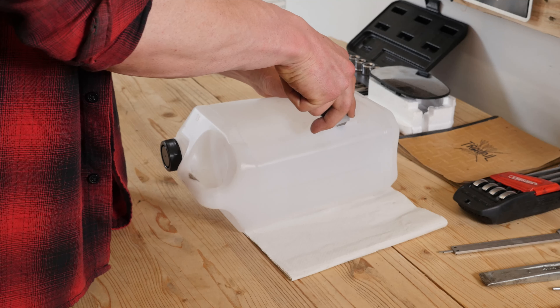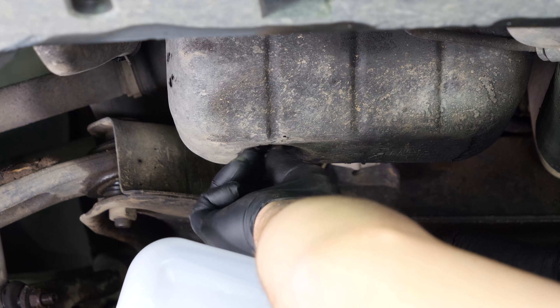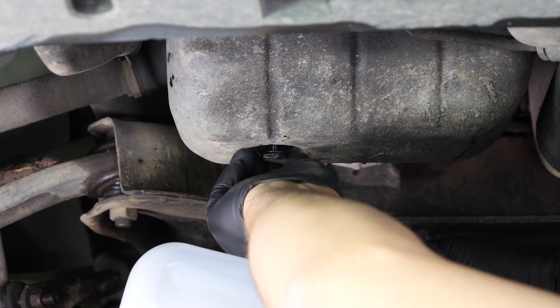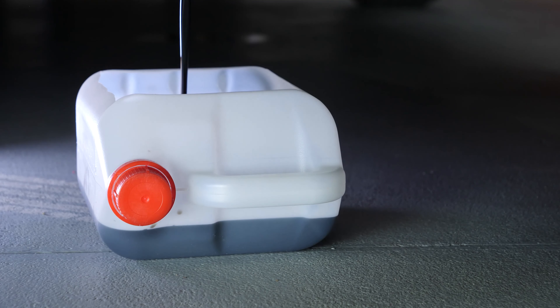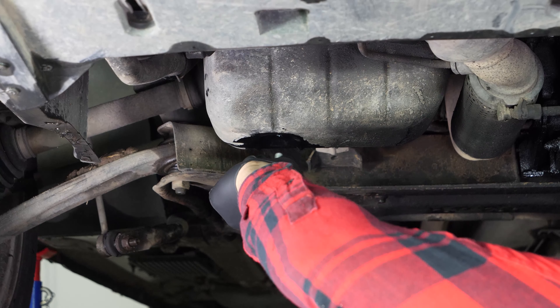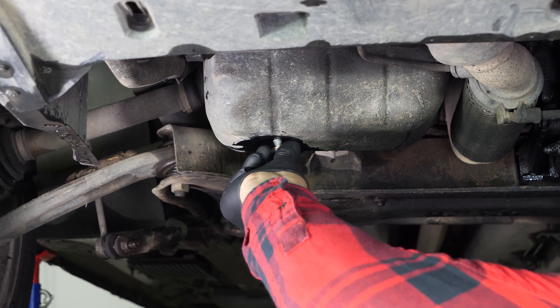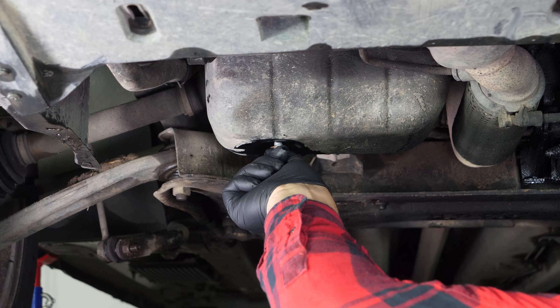You can learn how to make a collector by watching our video, 'How to make a collector for liquids.' Be careful on the last few turns of the screw — the oil may suddenly squirt out. Let the oil run out for 10 minutes or so. Replace the drain seal with a new one, then screw the drain nut back in. Start by hand, then finish off using a wrench, without overtightening of course.